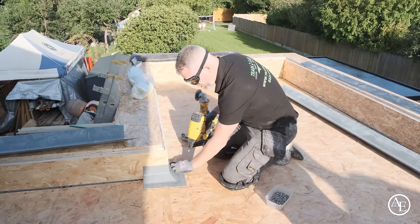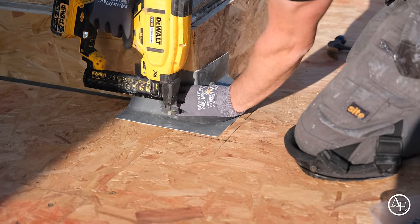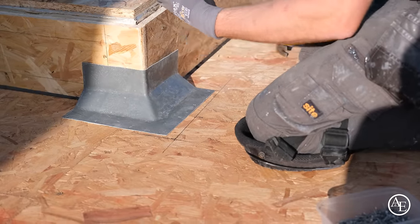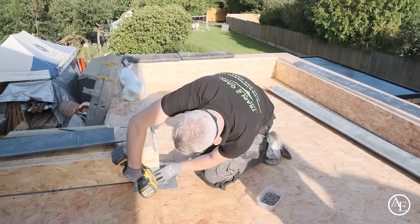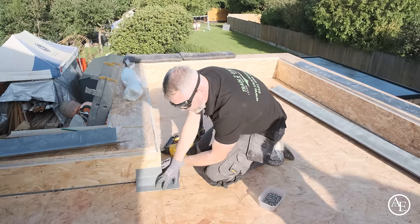And again, make sure it's pushed as it goes all the way around, and then literally every 100mm or so, and then just pin into the wall, because as you can see, they're pushing off because they're pre-made, and obviously the surface is slightly different, so just give it a tack in. There we go, and that holds that nice and secure on there, and fixed off already.